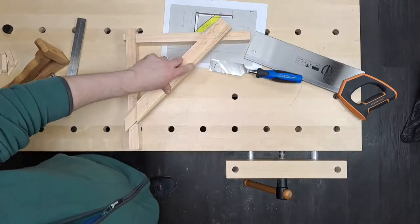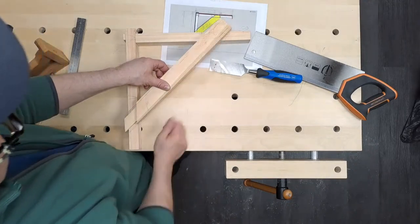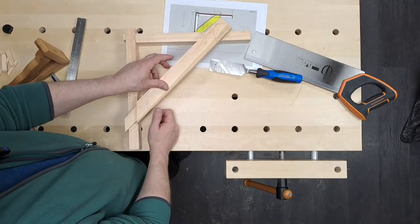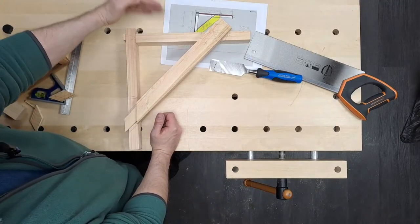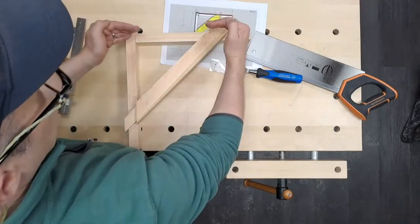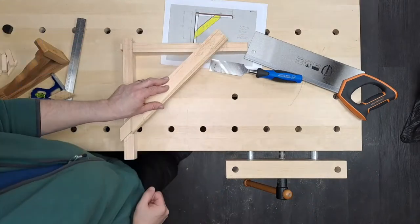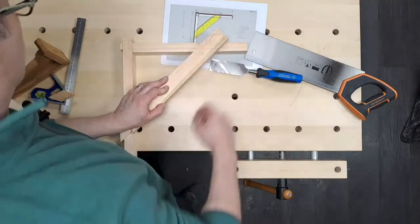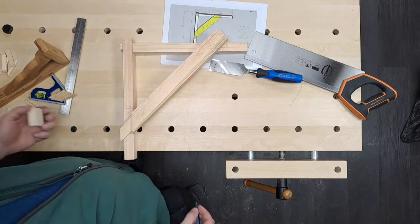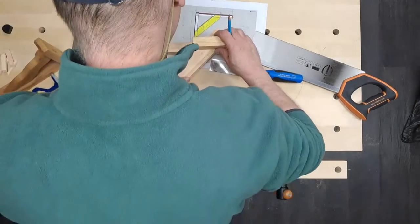Now, if you actually think about it, if we tried to squeeze this one in here, this would go in. And if we had all our angles going out there, there's no way we'd get that on and a dovetail. So we're going to actually have to take off the dovetail, take that piece off, put this one in, and then this will have to come straight down. And that's why on our working document, this has a straight edge along here. And that will make more sense when we cut it out. It'll look a lot more sensible then.